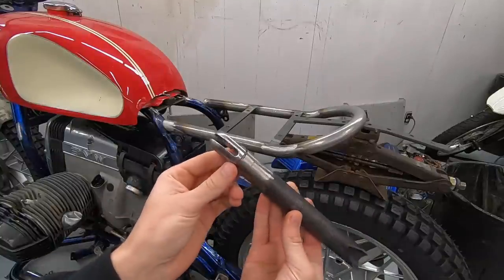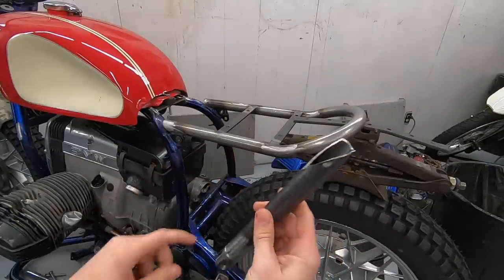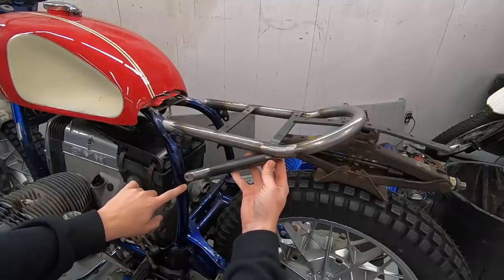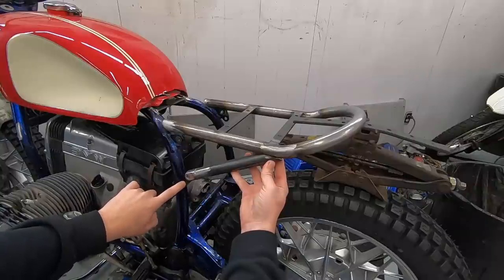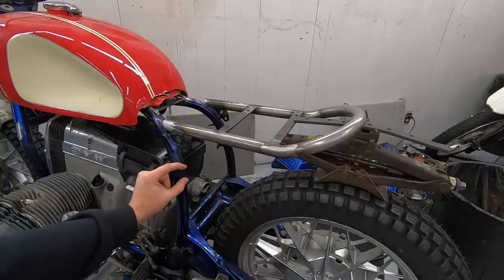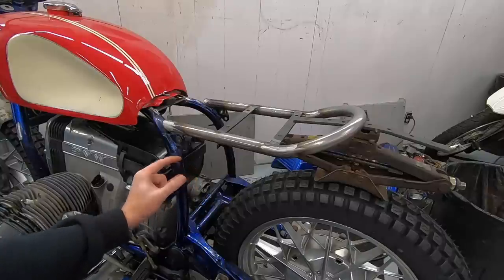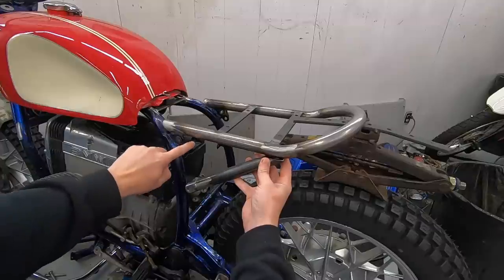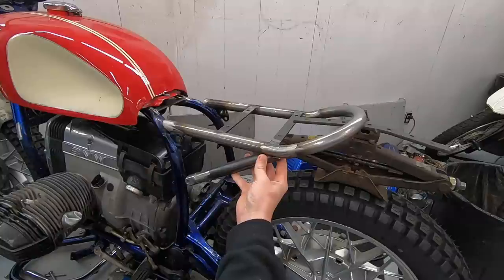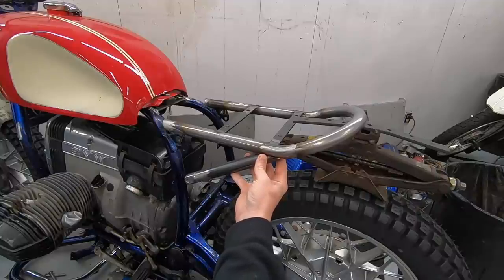I have both sides all made up. I just pressed in the clevis joints for now — I haven't actually welded anything — but I have all the copes done and it's matching up really nicely. I think it's going to be a good overall look. What I need to move on to now is designing and making the little tab that's going to come off the back of the frame. That's going to be quarter-inch plate. I'm going to start with cardboard to work out a few different designs — I don't want it to just be a square piece of plate, I want it to look similar to the one up here with nice soft edges, somewhat factory. Then I'll transfer it to quarter-inch plate, cut it out on the DoAll bandsaw, and we'll be ready to tack everything together.